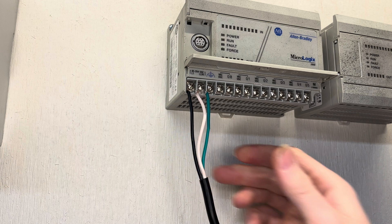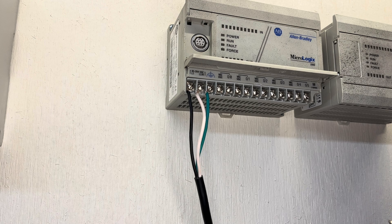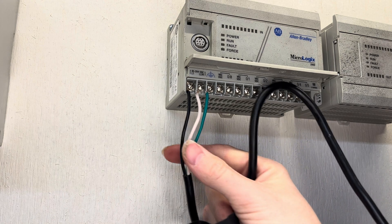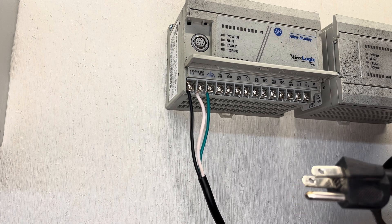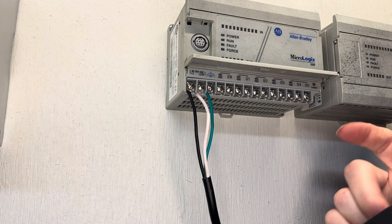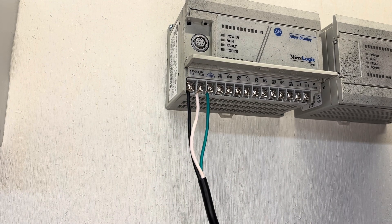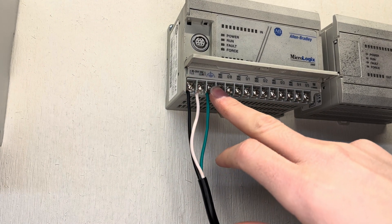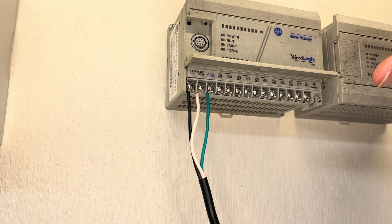Once you've made sure that all your connections are tight, you can go ahead and power it up. In this case I just have what we call a suicide cable — one side is a normal plug-in and the other side goes directly into your connections. The reason it's called a suicide cable is that it could be plugged in and powered on while the other end is not connected, so you can accidentally shock yourself. Believe me, I have done that in the past. So this is going to be for our power, and that's all we have to do to connect our MicroLogix for power. In a normal cabinet outside of a test bench, it might be directly connected into a breaker right next to it, or you might have a whole bus of breakers in one location — just depends on the situation.